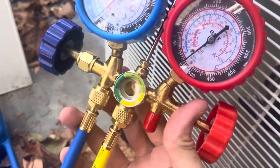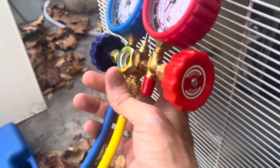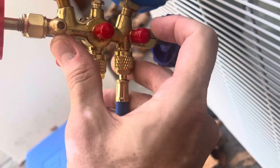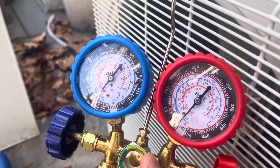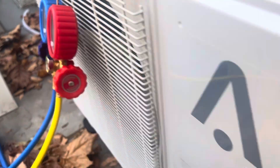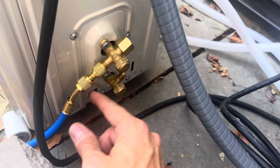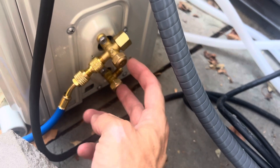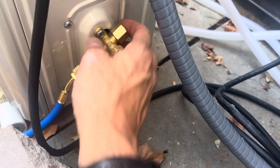I can tell you that I've tested it with just the gauge too. So I've taken this blue connector and just attached it to the back of the gauge set, this little guy here. And that doesn't do anything, and it'll hold a vacuum perfectly when I do that. So the gauge isn't busted — there's not a hole in the gauge. I've isolated it to this unit. There's something that it won't hold. It won't hold a vacuum between these two valves, and I can't figure it out.